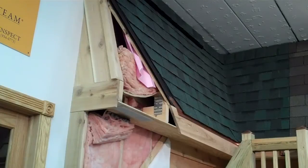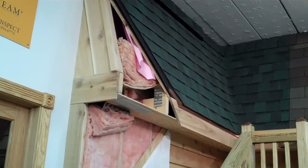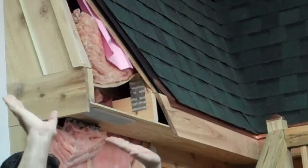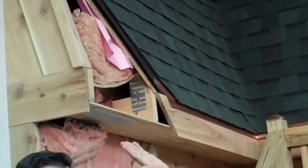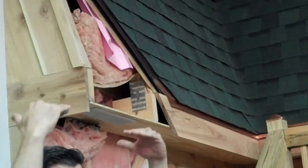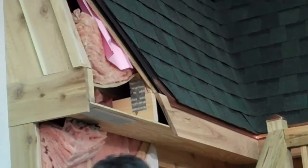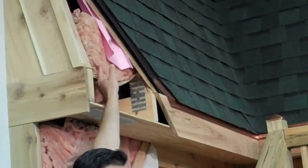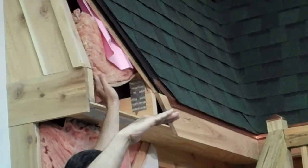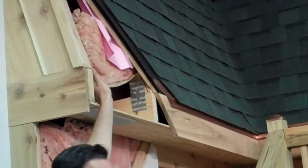Would you include a radiant barrier on the inside of the roof? They're putting up the insulation and paper in the crawl space and stapling it - but that's the vapor barrier. It should actually be facing the living space, the interior space. That's there to prevent moisture from getting into the insulation. If you reverse it, you're actually possibly trapping moisture inside that insulation.